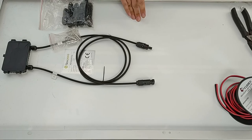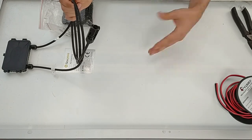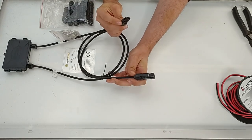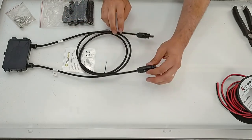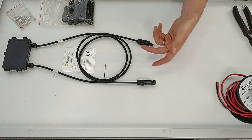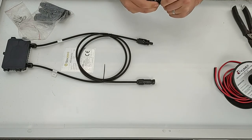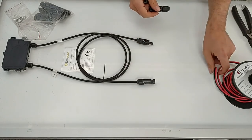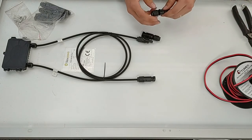Keep in mind I am just figuring this stuff out as I go along, but I want to show you what I'm learning. The back of all the solar panels — this is the smaller 100-watt one — but all of them come with these leads coming off a main power box, and they should all have MC4 connectors. The one that looks like this is positive, and the one that looks like this is negative. Some of the ones I got from Santan Solar, these were mixed up or had two of the same kind. Let's take a look at setting one of these connectors up — they just connect together like that, hooking up the positive red side.